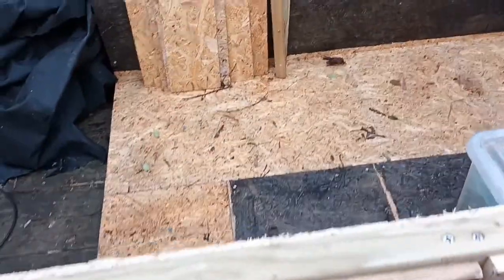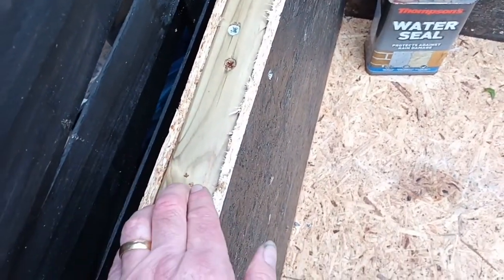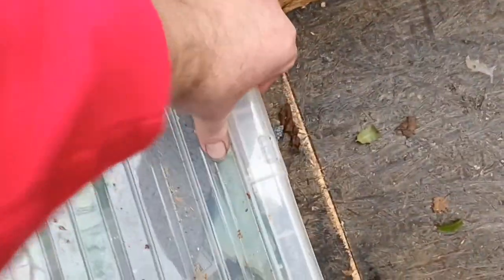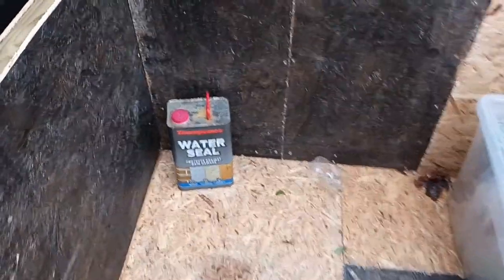Okay, I'm back. I've taken the cover off — it was only to protect it from the weather that we've had; I don't really want it getting wet. So we've got two sides up, one there, one there, and an end. Now they're all boarded inside and out with 100mm of insulation in the middle. The floor's got 25mm of insulation in it — this polystyrene stuff. So that's in the floor, with some left over to use up.